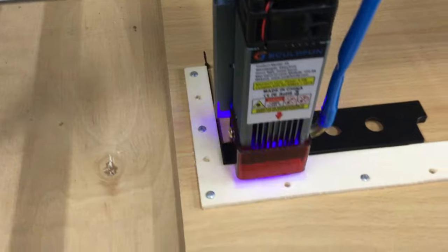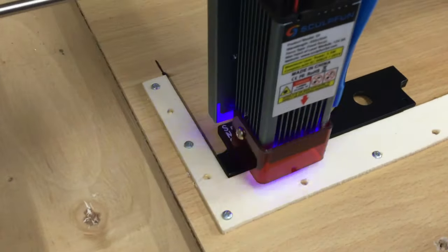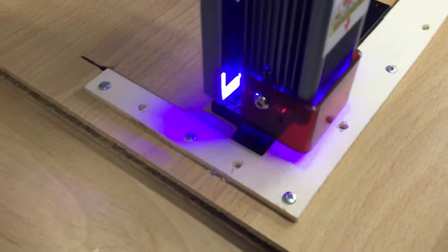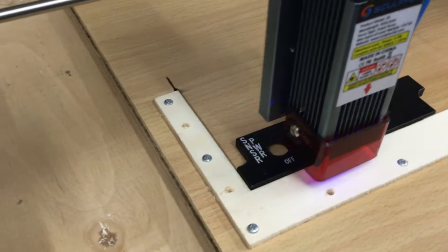I'm really lucky to have quite a fully equipped workshop, and with the addition of a laser cutter, backlighted panels, faceplates, and indicators became an easy possibility. The part is printed in white or transparent PLA, spray painted with 4 coats of black paint, and then the lettering is lasered out.